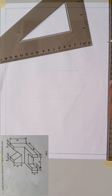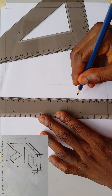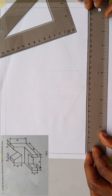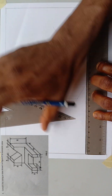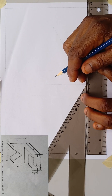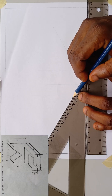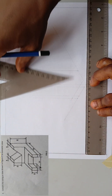Now that I've gotten that, the thickness of this end is 10 millimeters. So I'll leave 10 — if this is my zero, this will be 10 millimeters. I'll align my set square again and then tilt it. Always make sure your guideline ruler, which is standing in for my T-square, is properly aligned. It helps to minimize error.